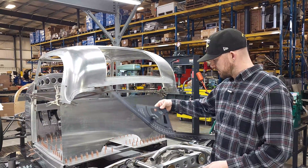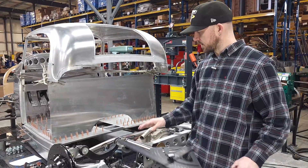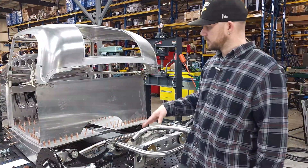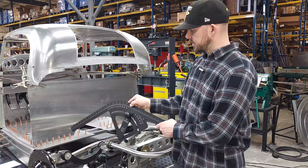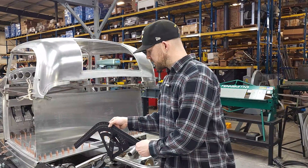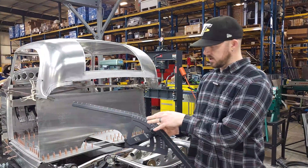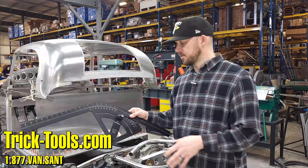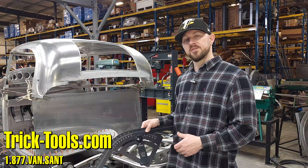Again, this was the eight-inch protractor — it's pretty big and too big to match what I've got here on this chassis. But even if you were doing chassis work like this, judging angles bending down and forward, you could use these in different ways to judge the angle not only on a straight vertical plane, but if your bend is going down but also out, you can lean this at that certain angle as well and make sure you're getting that bend angle dialed in before you even bend any material. Check out these Mittler Brothers Bend Radius Protractors on our website, tricktools.com. If you have any more questions, give us a call and we'll get those answered for you. Thanks for watching and we'll see you in the next one.